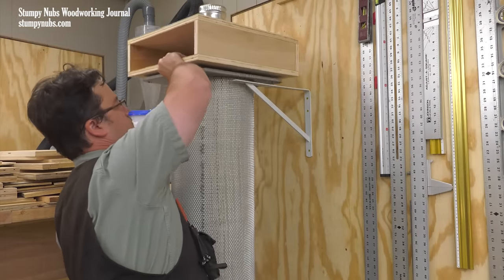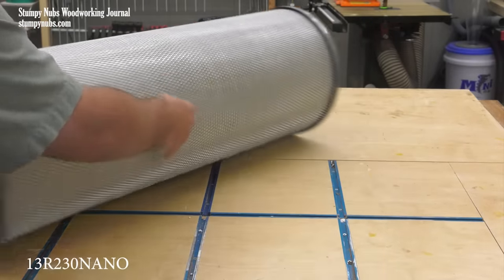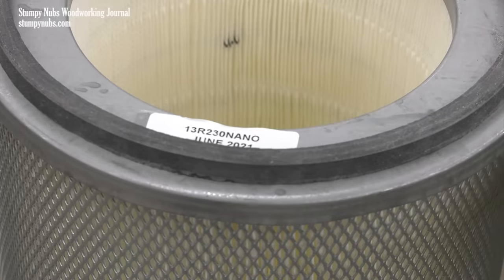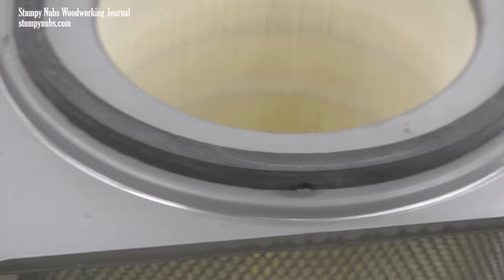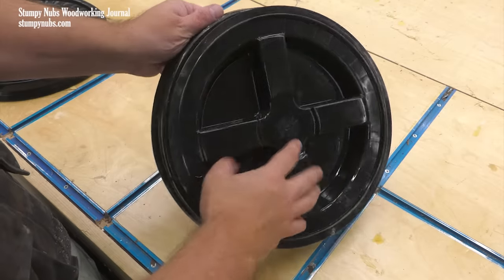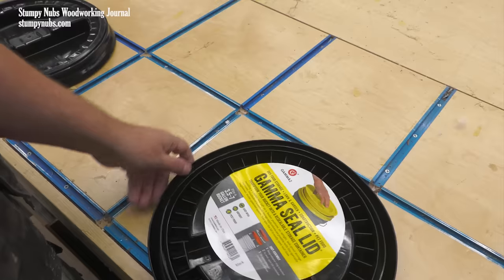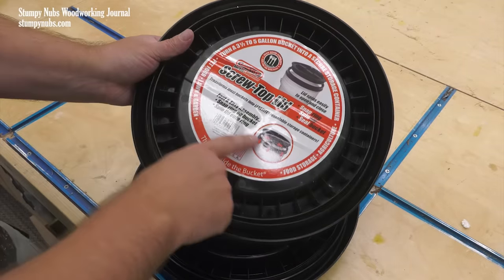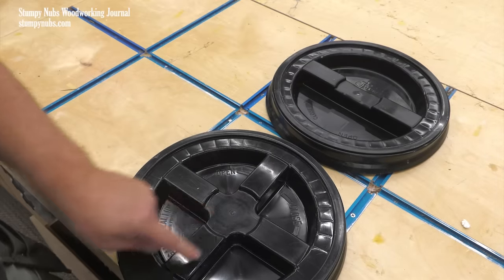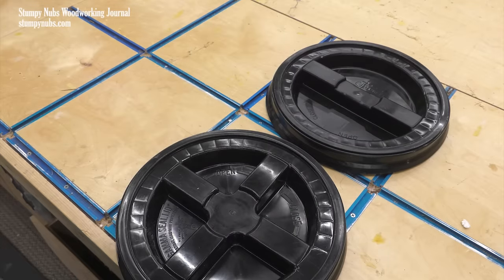But first I want to show you the other method. This is a 13R 230 nano filter, which is the same as the 13F 230 nano, except there's no flange at the top — I'm guessing that's why this one is 13R for round and the other one is 13F for flange. We're going to use a gamma seal lid to make this filter twist on and off our box so it's easy to remove for cleaning. Gamma seal lids are not the same as those generic five-gallon pail screw lids. A gamma seal lid has two cross members, while the other lids have a single cross member. It's important to use the two cross member version for reasons you'll soon see.